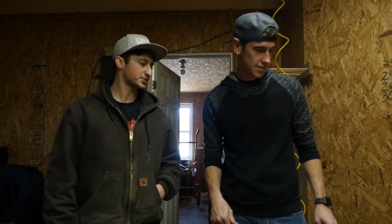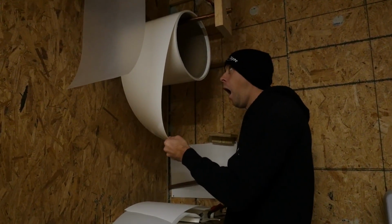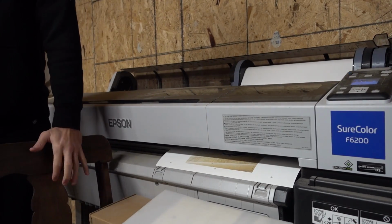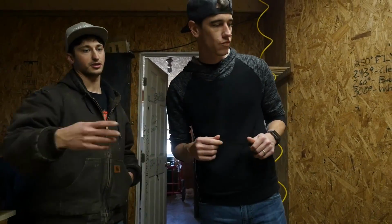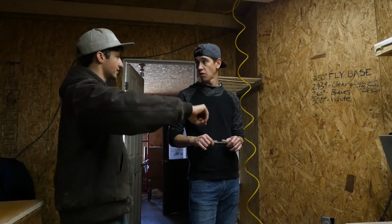This is our plastic room. This is sublimation. So we have 4 different types of plastics. First thing that we do is we'll take our graphic in Illustrator, we'll print it out on sublimation paper and ink. The plastic will go down first, and then the paper will go down on top. The solid ink is going to go straight to a gas and permeate right into the plastic. So now that ink is gasifying and going directly into that plastic, so you're going to have a perfect face.